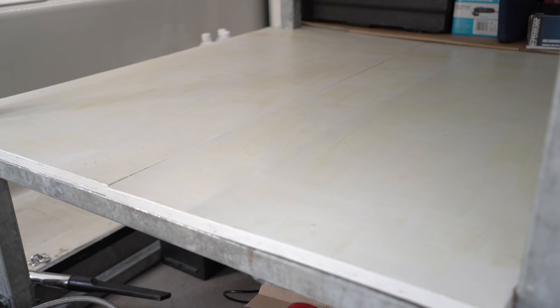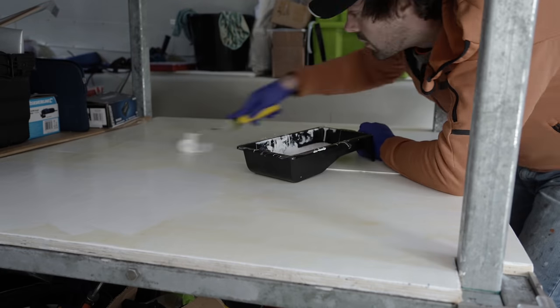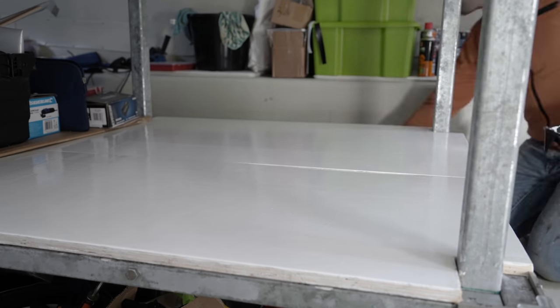Alan's very over-engineered table that you saw me build in episode 6. I'm coating or painting most internal spaces white, as this shows up leaks and reflects light around so I can see everything more clearly. It's also neutral, of course, which when filming means the colour balance in the camera's brain doesn't have a tantrum and make everything red or purple or something. You might ask what broke. Well, the polyurethane coating did. It's tough and hard, but promised to be non-yellowing. This is after just a few weeks, so I'm overcoating with my trusty tough general purpose one pack white paint.